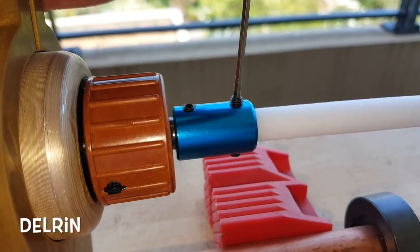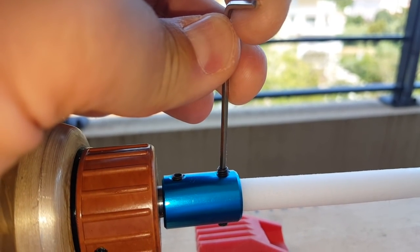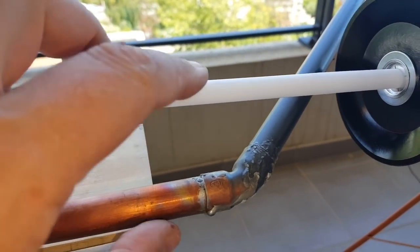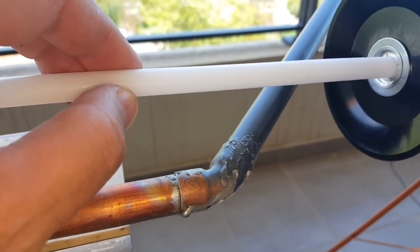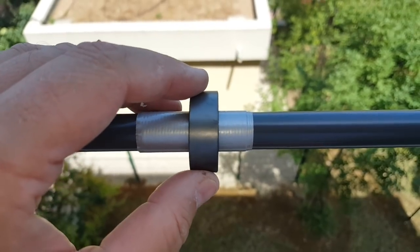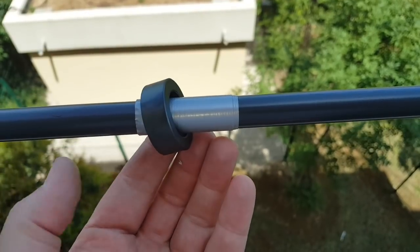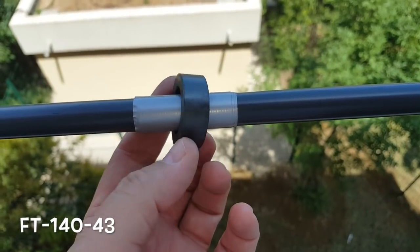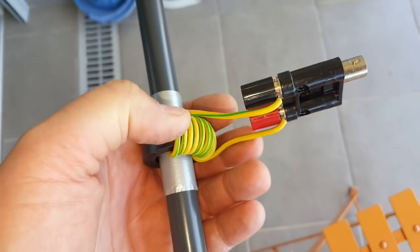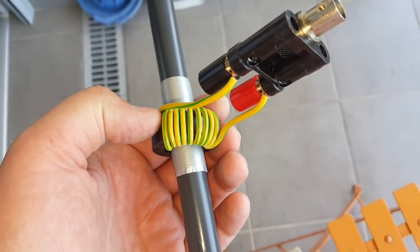The plastic rod is made of Delrin — that's the kind of plastic it is. I'm using a very large button and that helps in tuning. I'll have to make a 3D printed clamp here so that it doesn't move too much. The antenna will be fed at the top and I'm not using a large loop like some people do. I'm using this toroid FT140-43 and I'm going to thread some wire through it and make a few turns. I'm using standard house wiring here — single conductor. I put 10 turns but I suspect it's probably going to take about half of that. I'll just have to test.